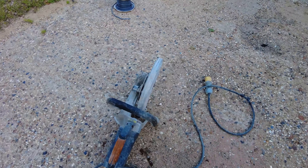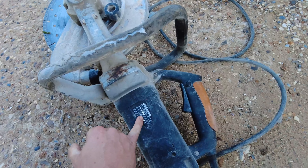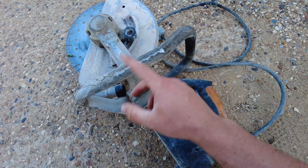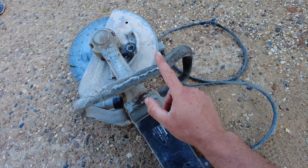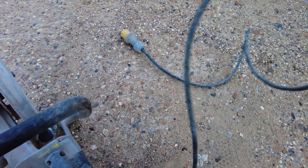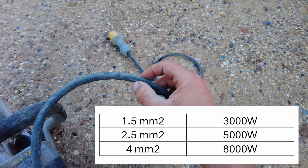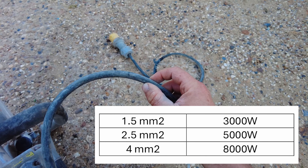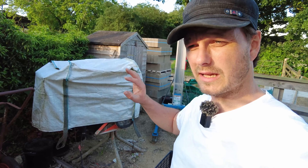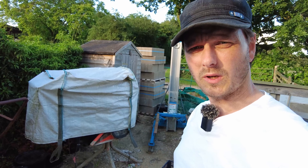Just to give you a general idea: this tool here is 2,000 watts, but on start-up it normally draws three times that, so it potentially needs 6,000 watts. That tells me this is likely four millimetre squared, because that can take up to 8,000 watts. Whereas on the cement mixer, it turns slowly, so that motor is not going to have a high wattage — that's why they've got away with one and a half millimetre.